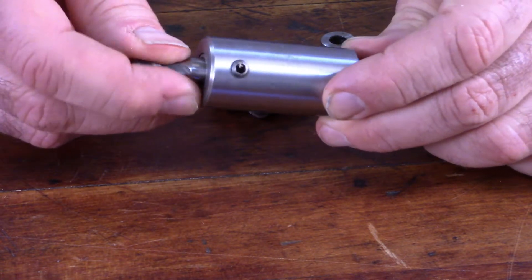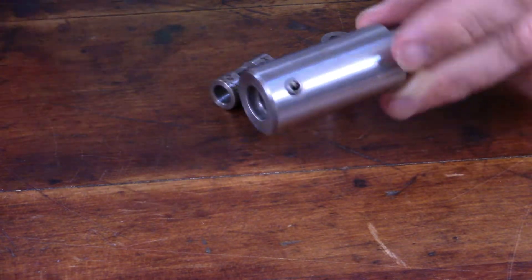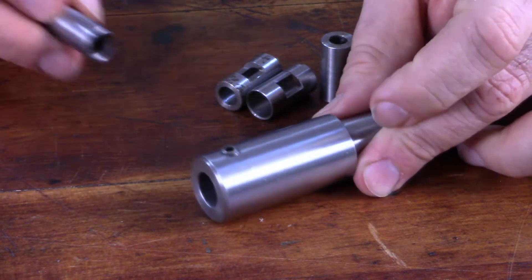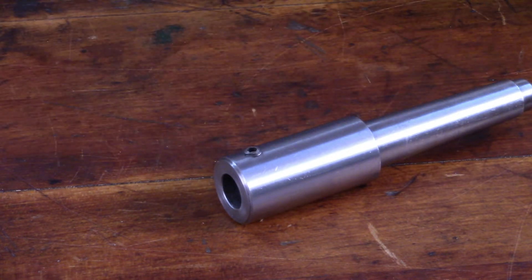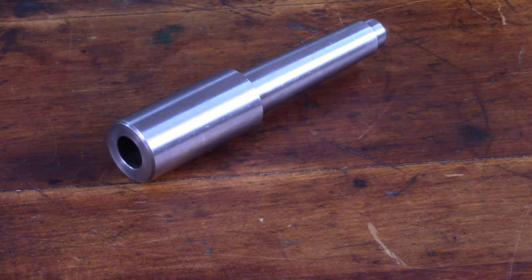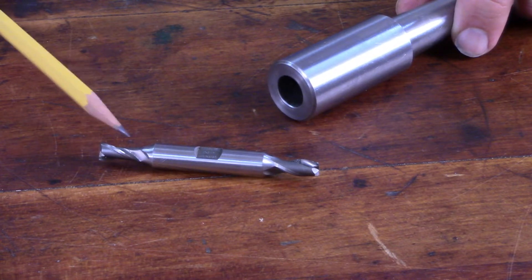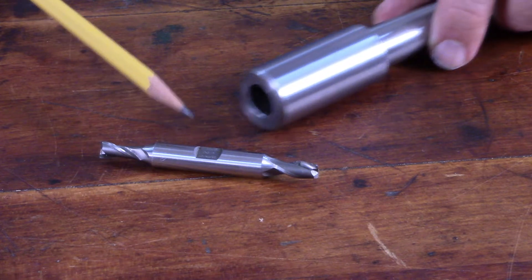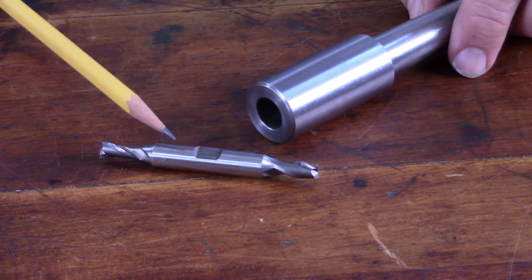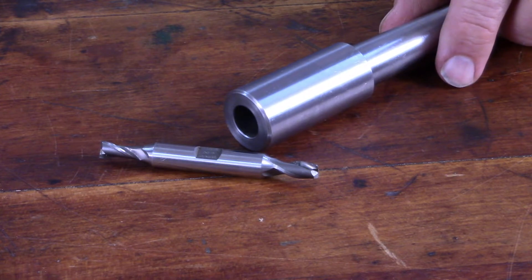The one thing I don't care for about it is that when you go to take the end mills out, sometimes that sleeve will get caught inside the end mill holder and you have to dig it out or shake it to get it out — it's just a little bit of a hassle. So what I was thinking is that if I had some different size end mill holders I wouldn't have to worry about those bushings. Almost all of the end mills I have have a 3/8 inch diameter shank, so if I just had one more end mill holder with a 3/8 inch diameter bore that would handle probably 95% of my end mills. Between that and the half inch I'd cover almost everything, and for anything smaller I could still use those bushings.